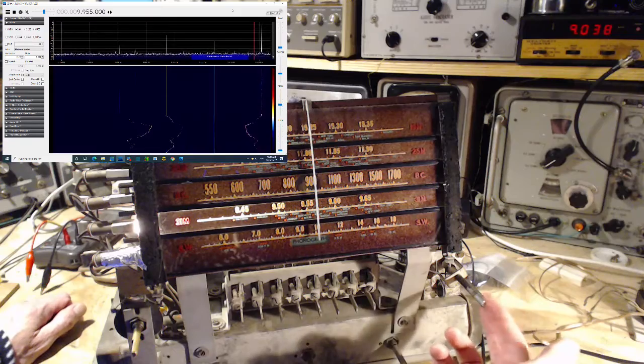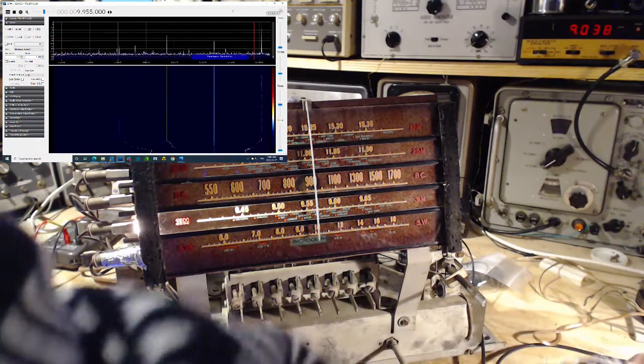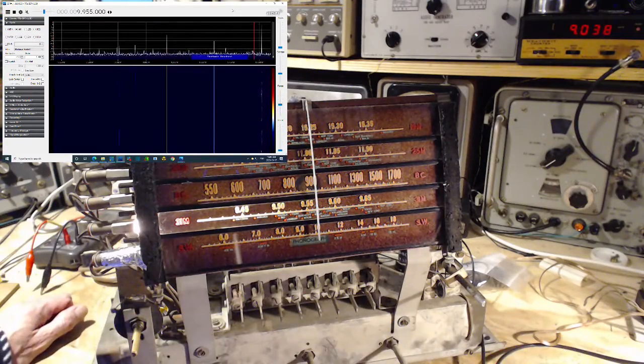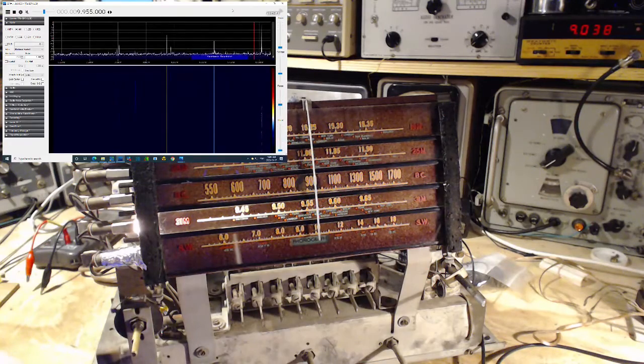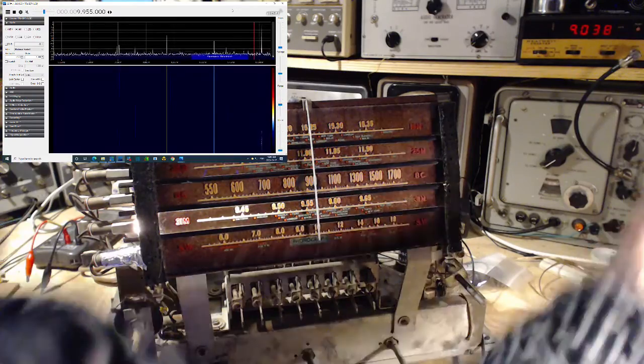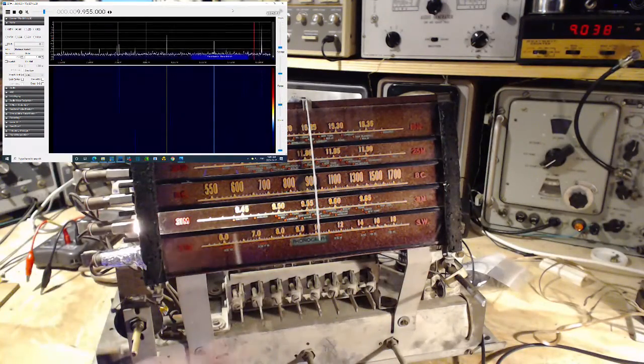Something's very microphonic. And just for that purpose, I have my microphonic checker. Oh my gosh, I get a chance to use it. Tuning fork. Let's see what we can do with this. I'm going to give it a whack, and then I'm going to touch it on different things. We'll see if we can figure out what's doing it.